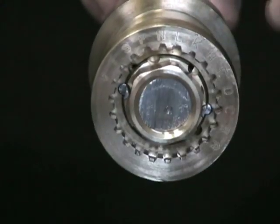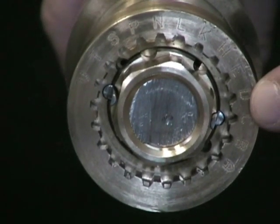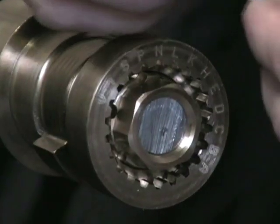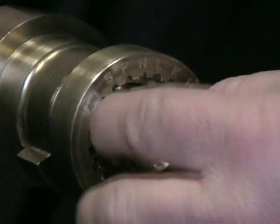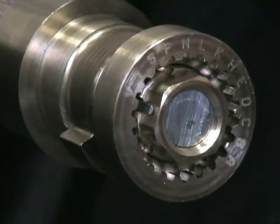When the pins are in place, the flat section of the pin is facing out and the full barrel is below the shelf — that allows the cone gear to seat fully. The flat needs to be below the shelf it goes into, so it's fully inserted so as not to bind up the flat surface of the cone gear.